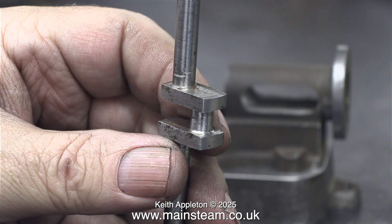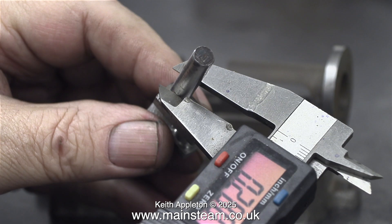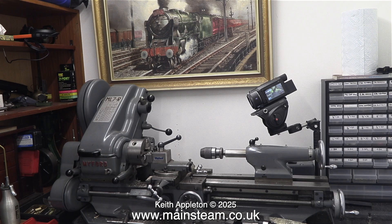This one is well not perfect, to say the least, but I think it's repairable. Machining a crankshaft at this size in a four-jaw chuck is no mean feat — it's really difficult to do. Please note I'm speaking from a non-machinist point of view. What I'm doing here is just taking some measurements with a digital caliper, and the measurements are not perfect — the crank pin is too big. This became apparent when I tried to fit the big end in place.